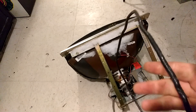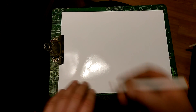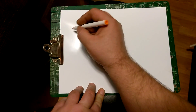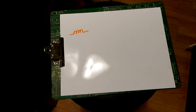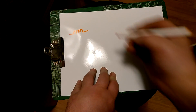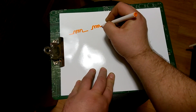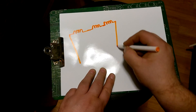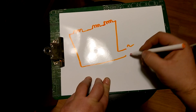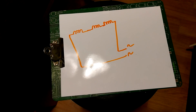There's another way around this: if you get three of these coils and connect them together. Basically that degauss wand is a coil of wires. If you get three of them from three of the same monitor models and connect them to your AC, then you won't overheat, and you'll basically make your own degauss wand.